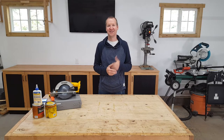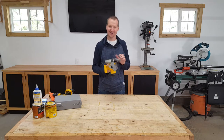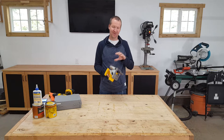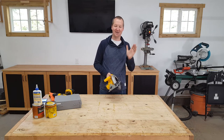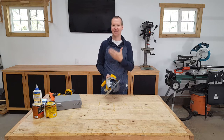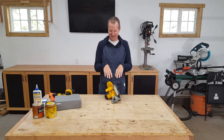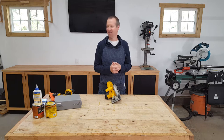I've got all the tools and materials you're going to need to get started. First we've got a circular saw — I have a lot of DeWalt tools, but it doesn't matter the brand really. The great thing about a circular saw is you can use it to make long cuts, cross cuts, and angle cuts. It's kind of a combination between a miter saw and a table saw, which eventually you're probably going to want both if you get into woodworking.